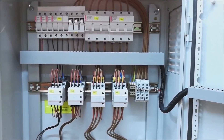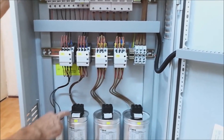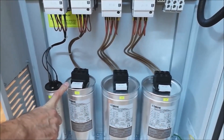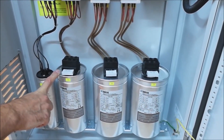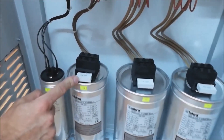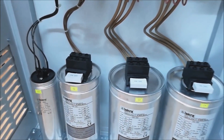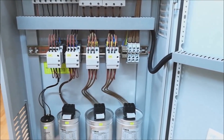It is very important to note that if you are ever in contact with such an electrical enclosure, you must not touch the terminals of the capacitors, even after switching off. A voltage that is life-threatening can be retained at the terminals of the capacitors for a long time. On the capacitors themselves, resistors are used to discharge them. Therefore, it should efficiently discharge the capacitor in about one minute and reduce the voltage to the allowed 50 volts. But in the case of failure, dangerous voltage can be retained for a long time.